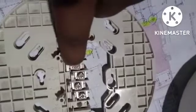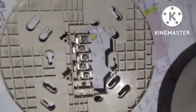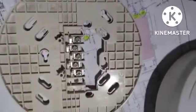The next device will also connect here. SLC minus is the negative cable and SLC plus is the positive cable. This completes the termination of the sounder base.